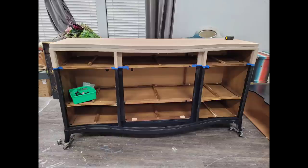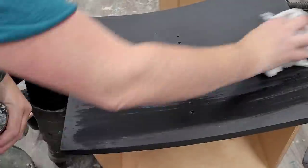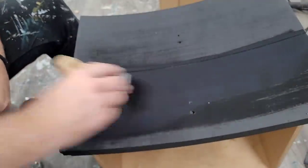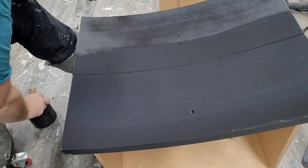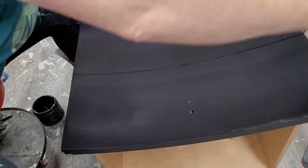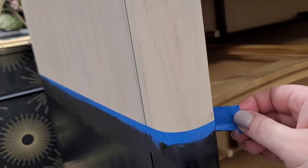Here's where I landed with the entire body done — two coats of black and the bleached wood on top. Now I need to get the drawers all caught up. This is my second coat of paint for the drawers. I do a light sanding in between, tack off all the dust, and use a nice soft synthetic bristle brush — these are from Rolling Dog, I get them on Amazon. I brush long even linear strokes with a little bit of water all the way across the front of the drawer. Let's pull some of this tape — can you see how clean and crisp those lines are? That's the clear coat trick.